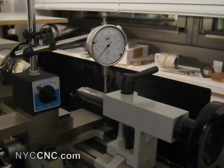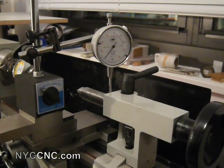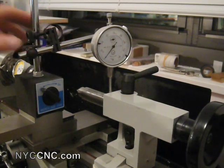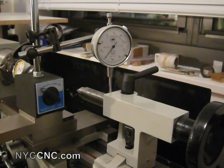Running it back to the start — I'm maybe just a few tenths higher, so I'm not really sure why it's indicating up a little bit when I return to the starting point. It could be the setup or something a little bit loose in my carriage, or it could be the fact that this is a relatively inexpensive dial indicator, and there's definitely some flexing in the arm here. But certainly proving the point that we know the tailstock is out — it's probably about six thou high, and if need be, I could shim it.